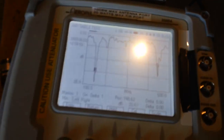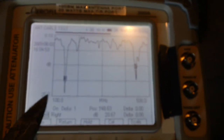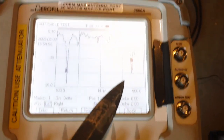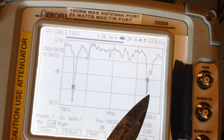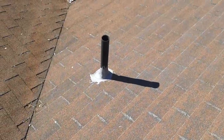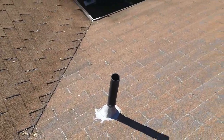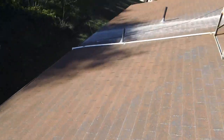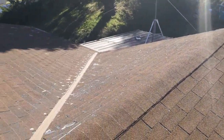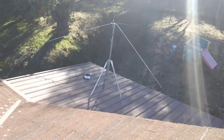I'm going to measure with this test equipment here, inside the garage. This is my 2-meter band that the antenna is tuned for, and this here is my 440 megahertz tuning. The whole idea of my experiment is to see if I can camouflage my Slim Jim antenna to make it look like any household or industrial material — where it doesn't scream 'antenna,' like that scanner antenna on my patio roof.